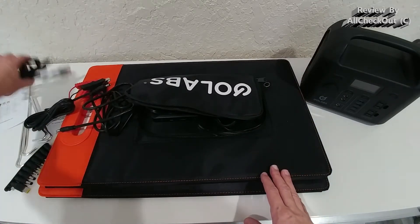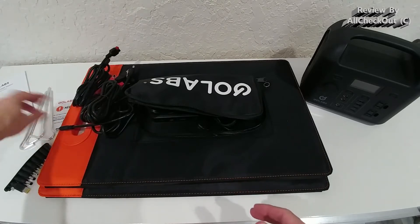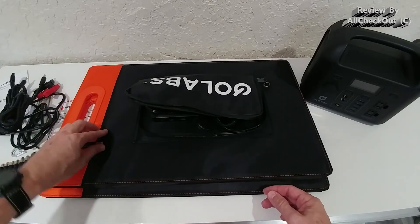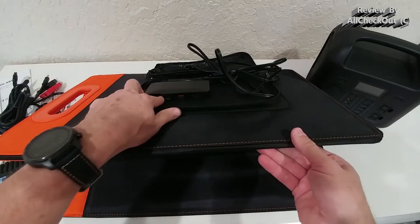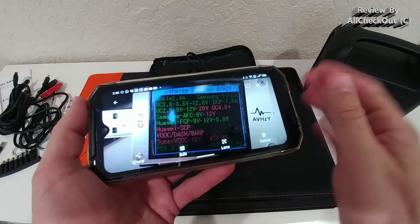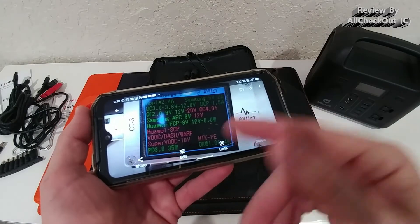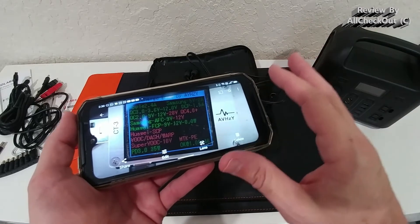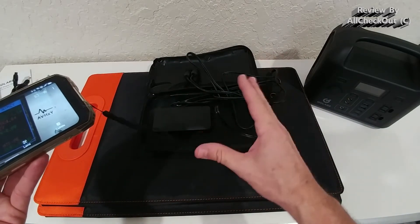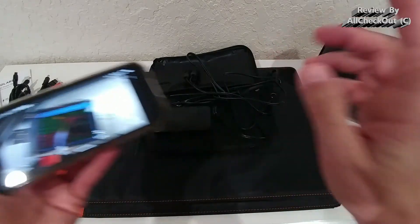The charging has been working really well. The accessory package is phenomenal — ground stakes, adapters, and additional adapters. I haven't seen such an amount of cables and adapters before. I tested all the USB outputs in detail. The USB-C showed 35 watts on the display, but I can confirm the peak USB-C/PD output was around 43 watts, very close to the 45-watt USB-C maximum.